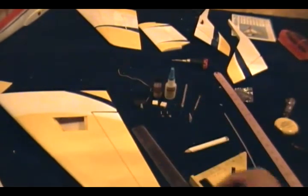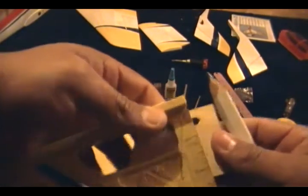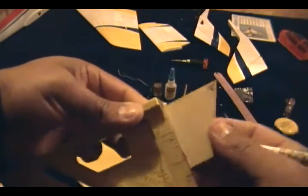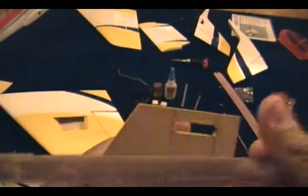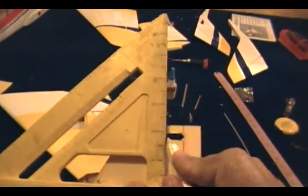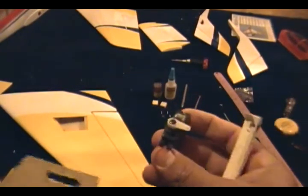First we need this little hatch. The first thing we're going to do is find the center of this hole. I'm going to grab my square, place it on the edge of this hole and mark it. Same thing on the other side — I flip it over so I have a better grip with the square. Now we have those two lines. I'll grab my ruler, find the middle of these two lines — it's one inch and one eighth — and mark the middle. Then grab the square, put it on this side. That's the center right there.